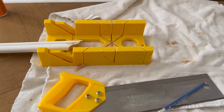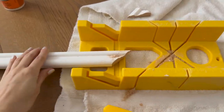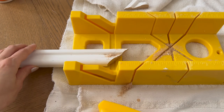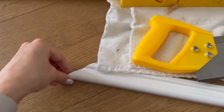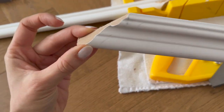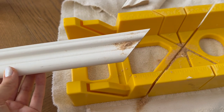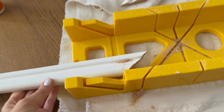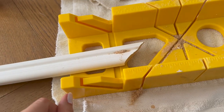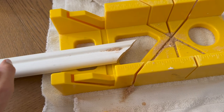If you've never done this before, something that always confused me when I first started cutting trim is that the off-cut is diagonal, so you'd assume you could just carry on and use it — but you can't. On the good piece, the longest edges of the angle are always the thicker, fatter part of the trim on both ends. On the off-cut, it's the opposite — the fat part is further in and the skinnier part sticks out. So you need to cut another angle, remove that little triangle, and then you can measure from there for your next piece.